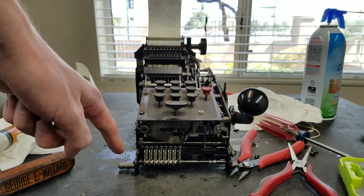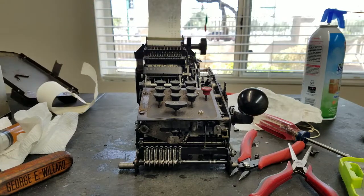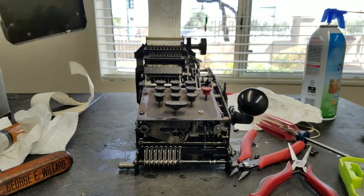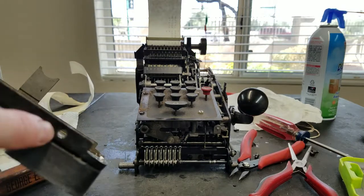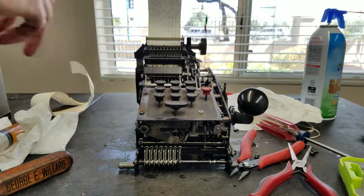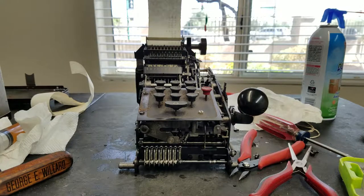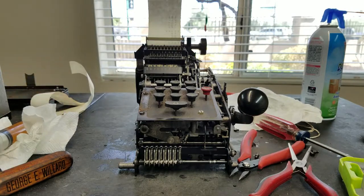You can see these posts here — the screws are going to the end of those. So when you set the machine back in the frame, these posts line up with these holes, which then line up with holes in the cover. So when you put those screws in, they both hold this to the frame and also hold the cover to the frame. So once you take those four screws out, you can take the cover off and take this off the frame. It's pretty easy to disassemble — you don't have to fumble with screws on the bottom or anything.